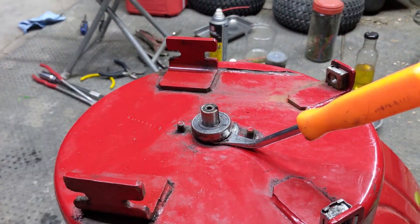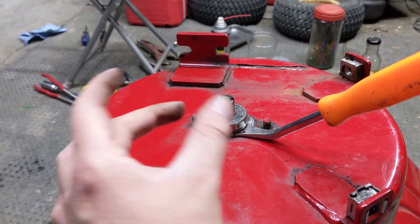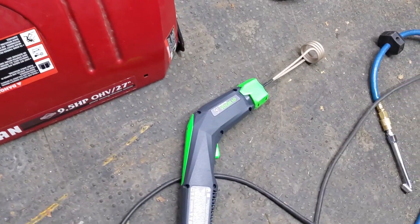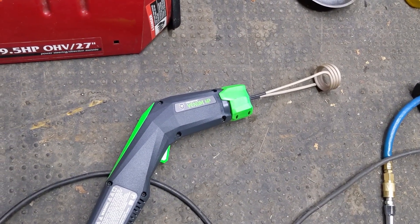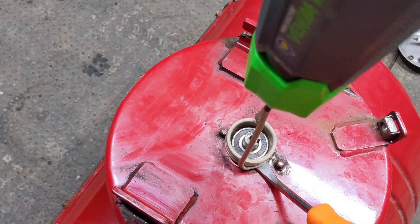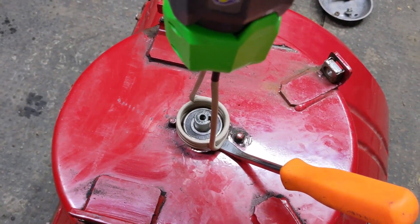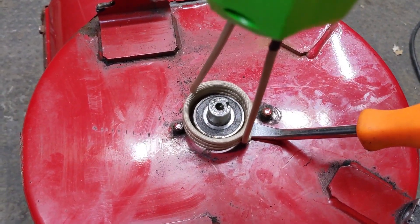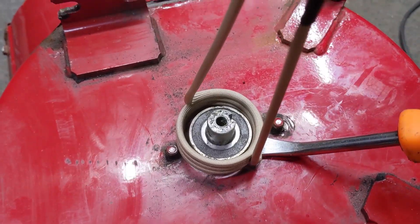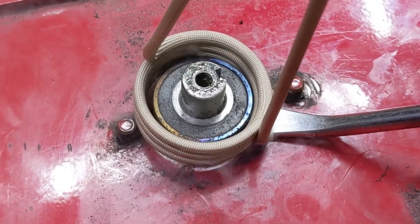The bolt and the pulley have been removed from the rear side of this auger housing, as well as the flange — you saw it there on the workbench, all damaged. In today's video we're going to be using a larger preformed coil with the Induction Innovations Venom HP induction heating tool, and I'm going to try my best to heat up the bearing. It might start to cook some of the grease inside the bearing, and I'm assuming it will start to smoke.